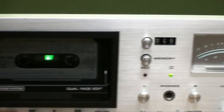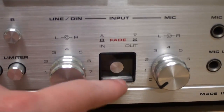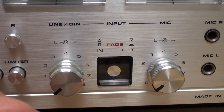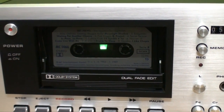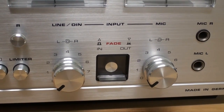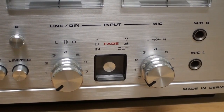So even on a pre-recorded cassette, if I press this button, I could erase that — stupid camera's losing focus. That's why we have that little flap in front of it. What the button does is, as you push it in, it increases the signal going through the erase head, so it fades out your recording. As you let the button go again, it fades in the recording. Basically, you can fade your music program in and out after recording, which is quite handy when you record something off the radio.